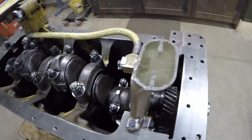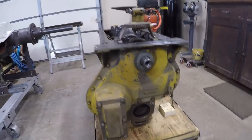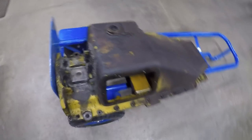I'm pretty happy with today's progress. I got that oiling system finished up and put the first of the covers onto 1113's new engine — looking a lot cleaner on the front there. I just want to do one quick thing: I'll grab a hold of this accessory shaft and do a quick backlash check. I can still see backlash movement on every gear in the train, so we know nothing's bound behind that cover, which is a good thing. Oil pan is going to be next — there's quite a lot of cleaning and prep work to be done, and it's held on by about eight billion bolts that are all going to have to be reconditioned, threads cleaned, and washers checked. But that's a job for another day. Thanks again for watching everybody — hope to see you back again. 1113's engine is going to start gaining a lot of weight next couple of episodes.